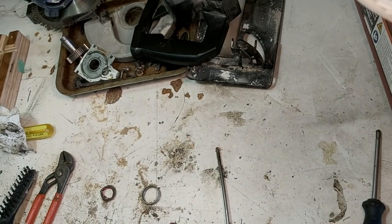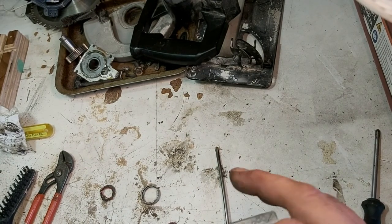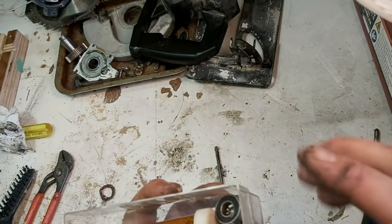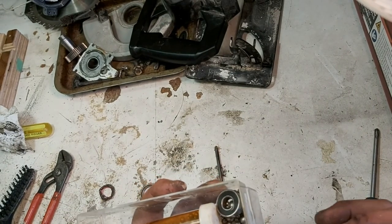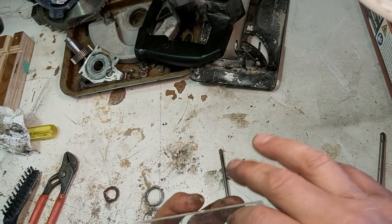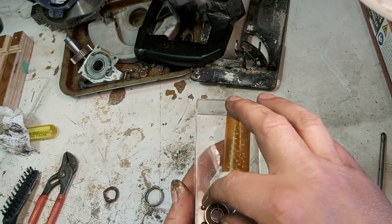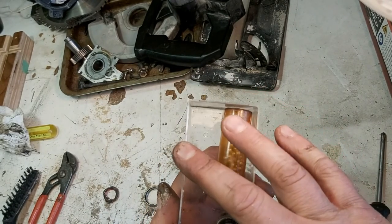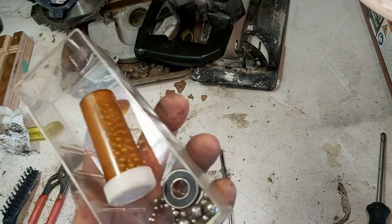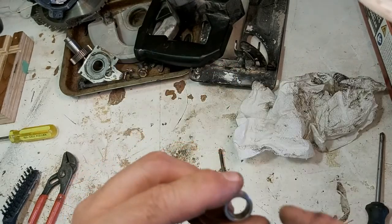And wait a second. I have no idea where these came from, but the thing is, once I had a floor jack and it wasn't working, and I remember I was at another place taking it apart to clean it and prime it. I saw a ball bearing on the floor and I thought, no, that never came out of it. They were using a ball bearing as a check valve, so I got the jack home and put that in. And I was able to save the jack.